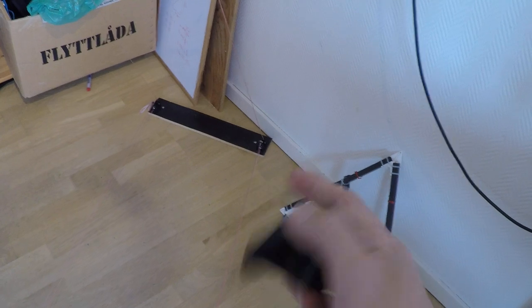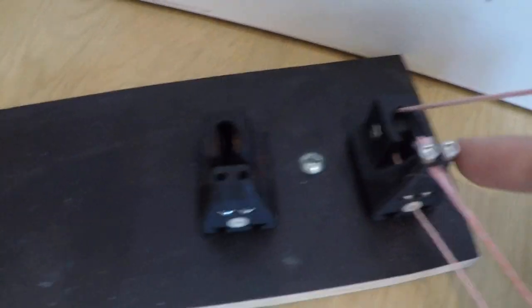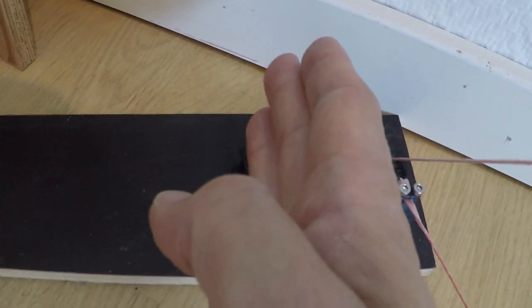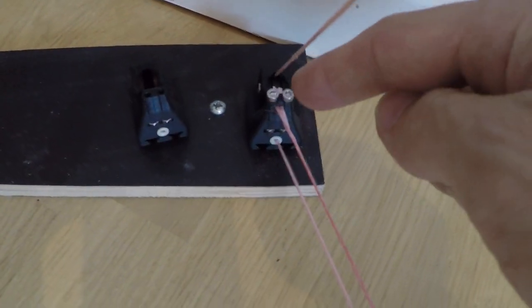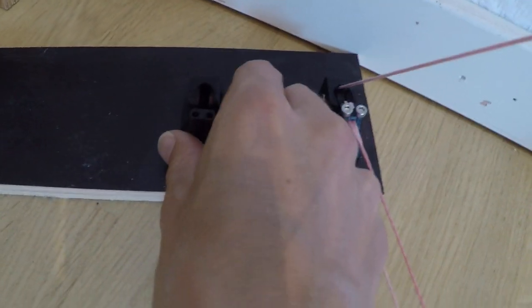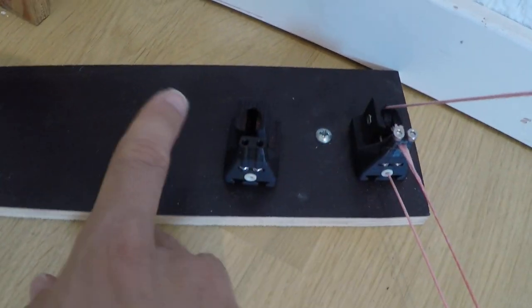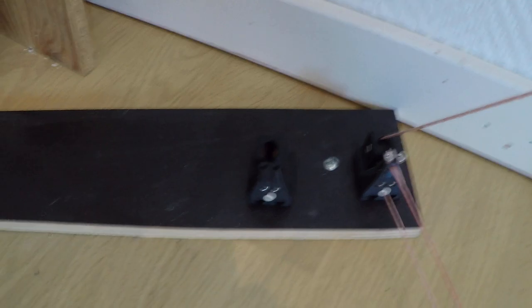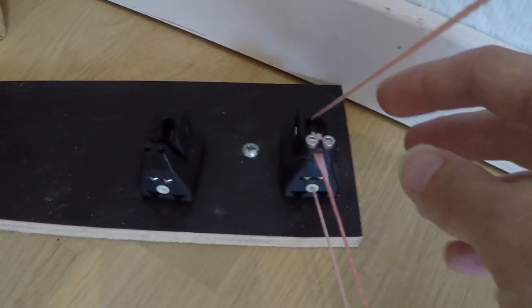This one was at that anchor position. I'll climb closer. It was mounted there, and you can see this part is tilted one way, while on the new part it tilts the other way — and the line comes in from the right slightly. On this one, there was a very sharp angle onto the bearing. When I had such a sharp angle onto the bearing, the line started twisting as it was fed onto it.